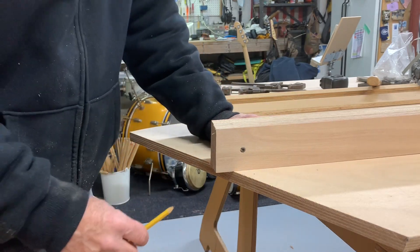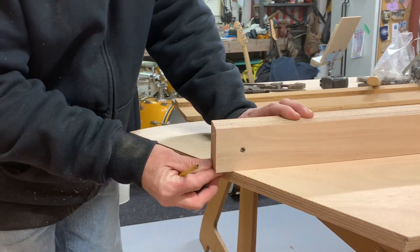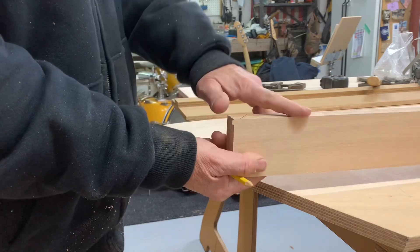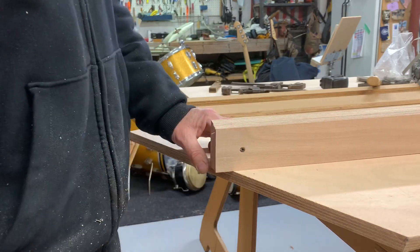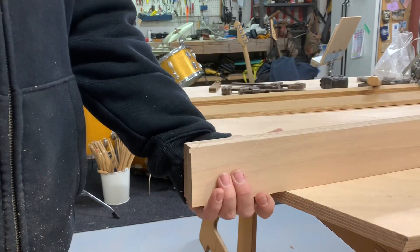I have this up on my 12-inch mark that I measured off the height here. Just going to scribe the underside of this. That bevel is going to meet this flat part of the transom. I'm going to cut that on the miter saw.